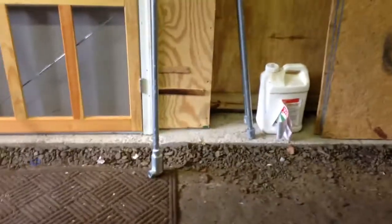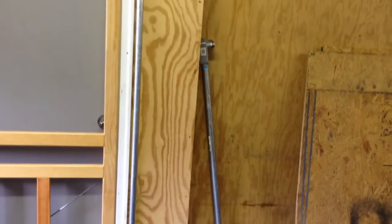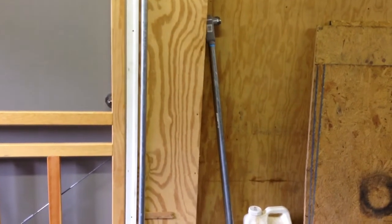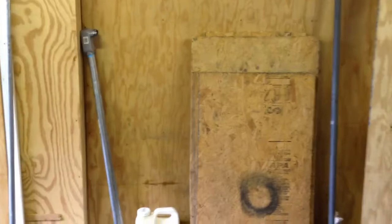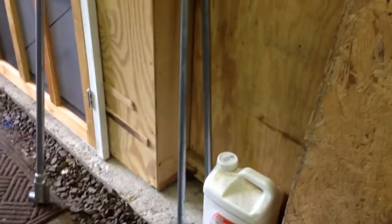Threaded up a bunch of 1 inch and 1/2 inch rigid conduit. So it's all going to be fitted to the boxes. That's great. Took a lot of measurements and measured it again because part of it goes underground, part of it has to come above ground. And if you cut it too short, it's too short. So I was real careful with that.